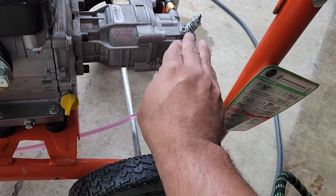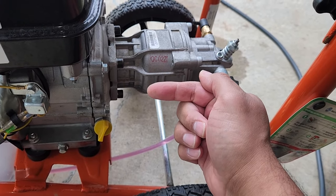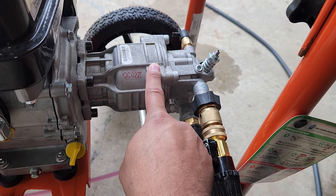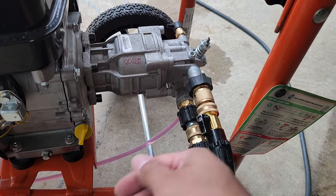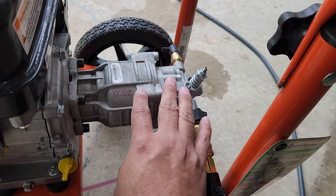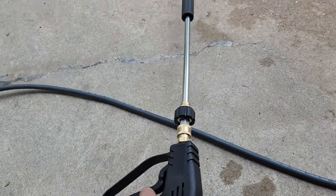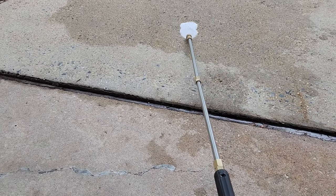You always want to make sure you have water running through the pump. If the engine runs for a significant amount of time without water through the pump, it will burn the pump out. This pump has oil in it, gets really hot, and it cools itself down by using the same water running through it. There's a pressure release valve over here - if you ever see water squirting out, that's because your pump is overheating. So always have water running through the pump before you start it. Now I'm going to depress the trigger and make sure water comes out of the wand.